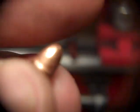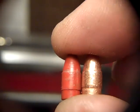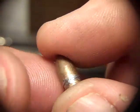I guess they just invented that snugging cut maybe 50 years ago. But anyway, their factory bullets don't have to be that close, because they run them through that machine that rolls them and crimps them and puts the knurling in there. Now, with the bullets that I make that are powder coated, knurling is completely unnecessary because of the powder coat. And that's the big advantage of my bullets.